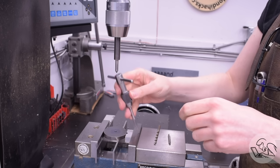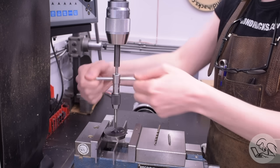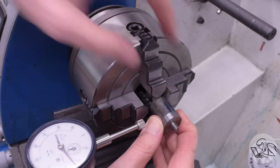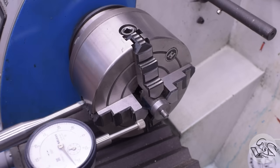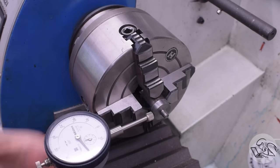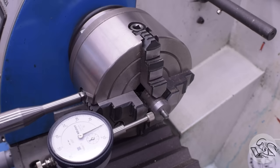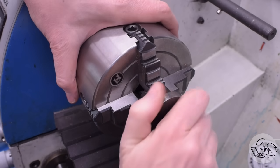If you've been watching this series, you know that I regretted tapping this reference hole immediately on a previous part. However, this time it's going to be okay because we don't need this reference for anything other than turning the OD, and then the OD is going to be the reference for everything else. So in comes the threaded mandrel that you saw me make previously. I've got that diameter turned on this thing, which was turned in the same setup as the threads were cut, which allows me to reinstall this mandrel later, dial it in, and get an accurate reference on that center once again. I've learned the hard way to always turn a reference diameter on the back of a mandrel for just such occasions. There have been something like four or five parts in this kit so far that have either a 6mm hole or an M6 thread in the middle, so this mandrel has definitely paid for itself.